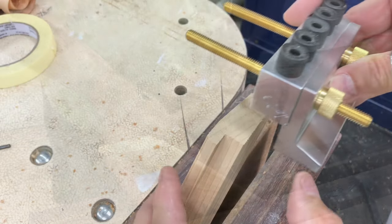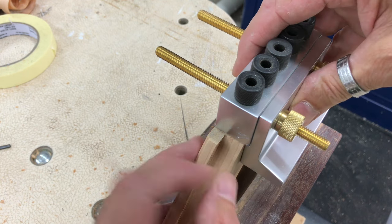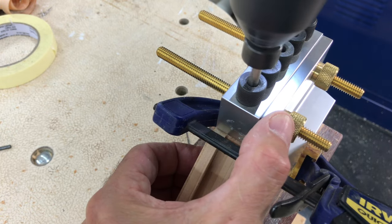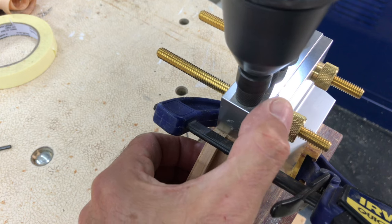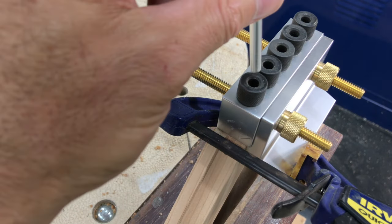With these pieces I used the back as my reference face because it was the only flat face, and I used the edge of the rebate as my reference edge. Doing it this way would ensure that the inside corners of the frame were perfectly aligned, and if there was any slight difference in the width of the pieces that's easily fixed on the outside of the frame.